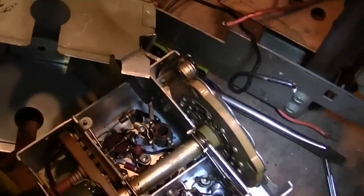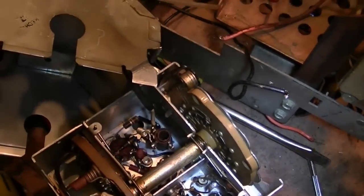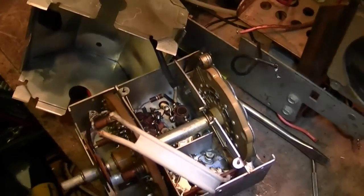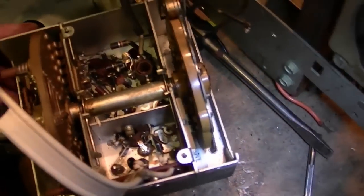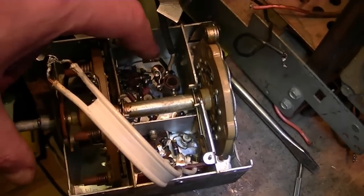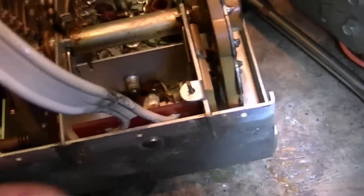But boy, I do not dare start poking my fingers down around in there, because that would mean, I mean, it wouldn't be a lost cause. It would just mean that I would have to align the tuner, which is something I'd really rather not do. Because when you get in there, the frequencies are so high, you just move a component, like push this resistor over a quarter of an inch, and you throw things off. You gotta be really, really careful when you work on these.